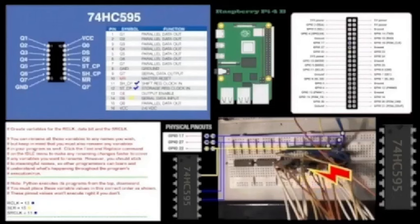Remember: you need the exact number of shift registers to make a happy equilibrium. If we're going to use all three, they're a glutton — they need all of each chip used, or it just won't go right. I've played with it and it's really weird. If you use part of a 16-bit register for binary counting, it won't work right. You have to use the whole shift register. If you want 16 lights, use 16 bits — not 8. Shift registers like to be happy — keep them at equilibrium.